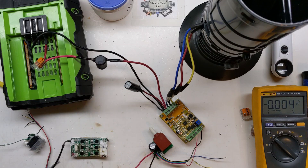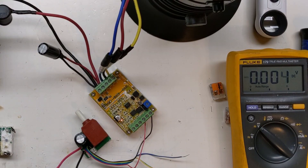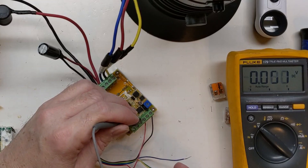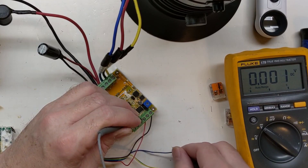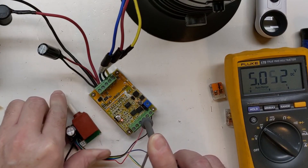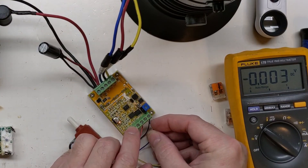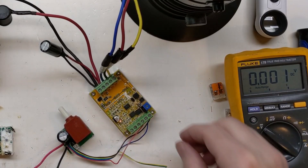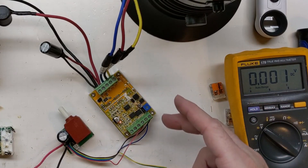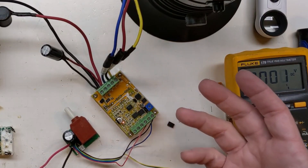Back now with this wired up — the configuration works pretty well. We have the contact breaking the circuit from the five-volt plus, going through the potentiometer part and coming back. Even though the colors are backwards — five volts and ground — that's how this board worked out. Yellow and green are joined together. Going to the blue wire, which goes back to the pulse width input signal, we can see it eases up to five volts — that's zero to five volt, or zero to 100 percent operation. If you remove the jumper and go to your five-volt common, bringing your own potentiometer wiper back to the PWM input, that's exactly how you do the remote pot on this board.